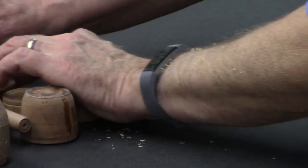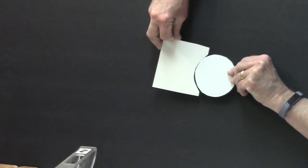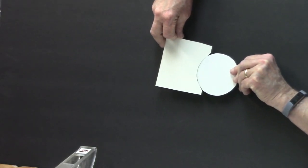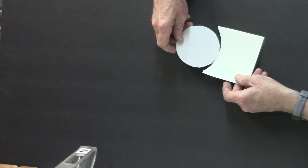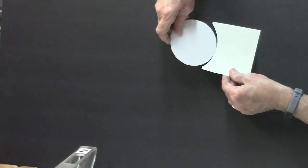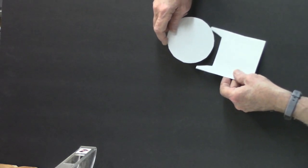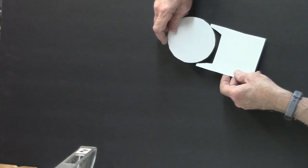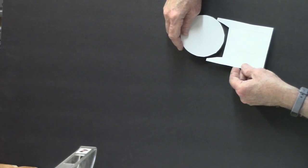Let me illustrate that a little bit better. When you've got it concave and come in with the sphere, you may not get it exactly right. The challenge is getting that profile to exactly match, and if it doesn't, you're only going to get it rubbing on one spot, and that's not going to work. With a slightly larger sphere you might get a larger contact spot, but it's still not going to be right. But if you've got one with pretty square walls, it will accommodate rubbing on the outside walls for stability on the larger one, and also accommodate smaller ones — still anchored on the outside.